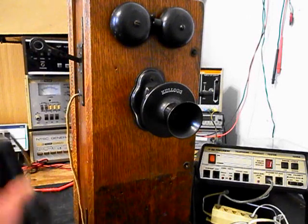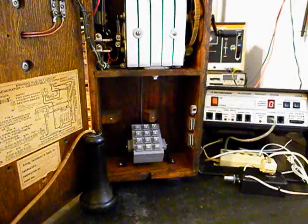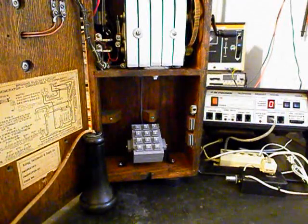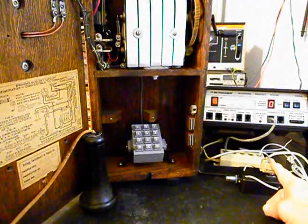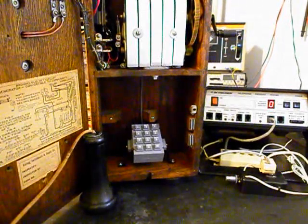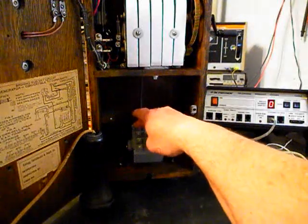We'll go ahead and hang up our receiver. Now what we want to do is open the door and make a telephone call with our keypad, and we'll call a time and temp number, so we'll be right back. Okay, we're back now, and we're ready to finish up our final checkout. Now we want to go ahead and press the button on the switch box. That will give us a line out, totally take the analyzer out of the situation, and we can call our time and temp number. Now we're just going to use the line cord for the hook switch because we have our receiver capsule right here. We want to push our line cord in and give you some dial tone. And we'll go ahead and make our call.